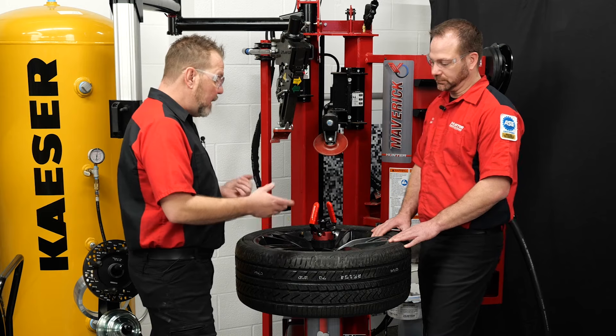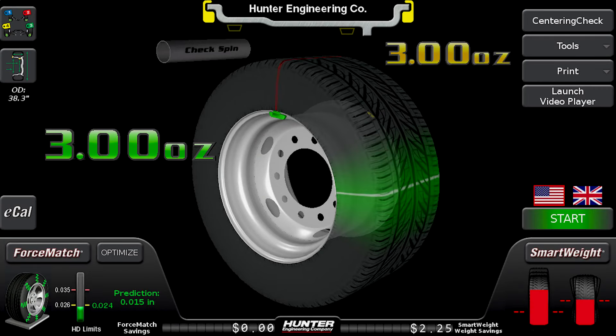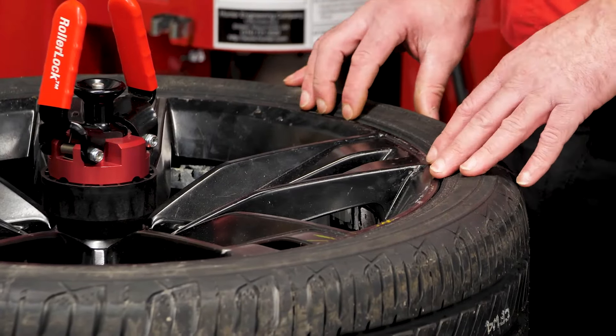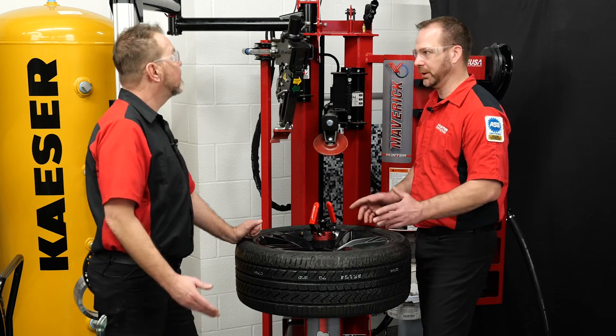This would be great for new tires, and it'll also help with an older tire that you didn't like the road force numbers on. This is also becoming a best practice — some manufacturers are saying it should be included when mounting tires. It's part of a procedure for vibration diagnostics and repair for some manufacturers that require a road force balancer in their arsenal of equipment for tire changing.